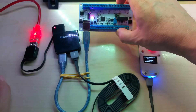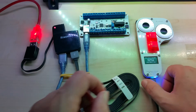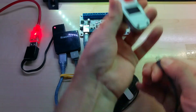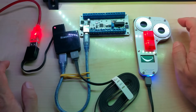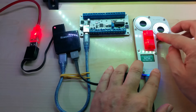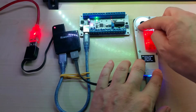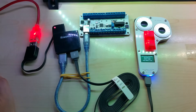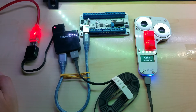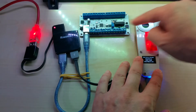The board is now connected — as you can see the RX/TX LEDs are blinking. Let me move the X-axis. Just one second, doing this live. You know why it didn't move? Because I didn't have Universal G-Code Sender highlighted — I had the Opera browser in the foreground. Now I have Universal G-Code Sender in the front, and as you can see when I move the X-axis, it gets enabled and the red LED goes on.